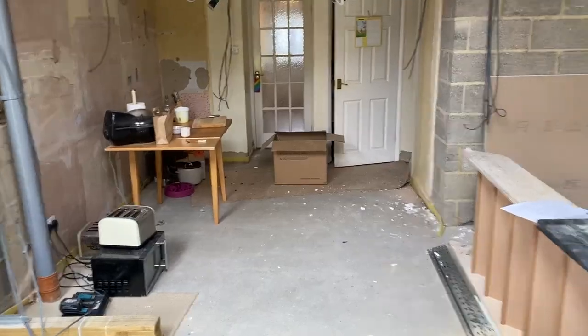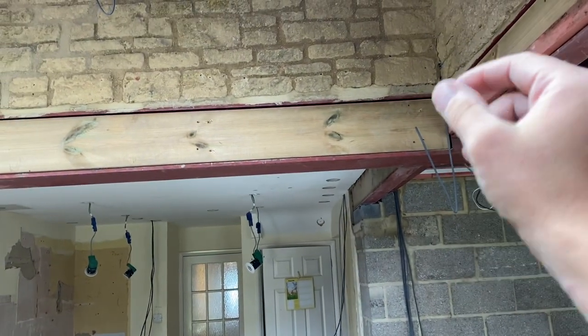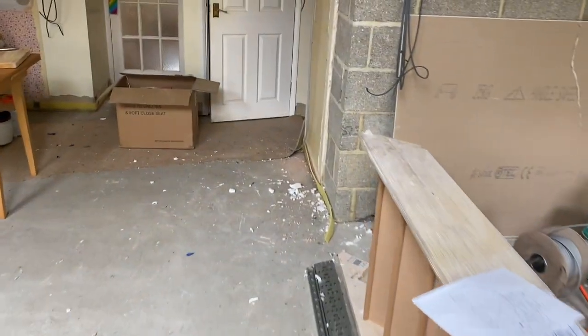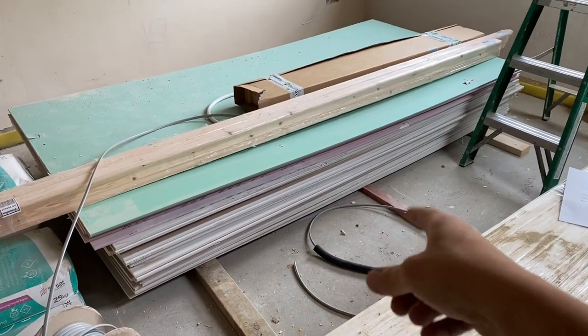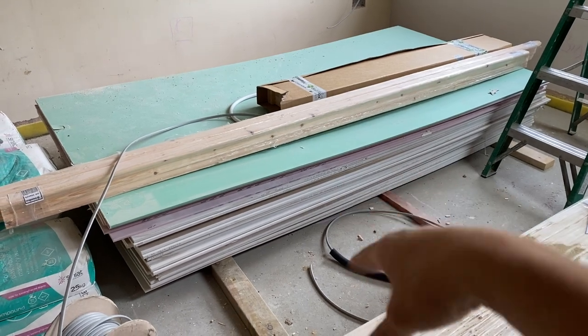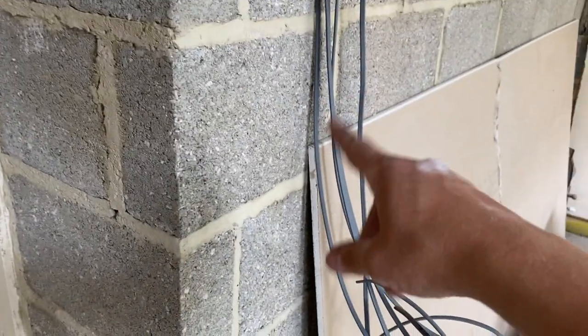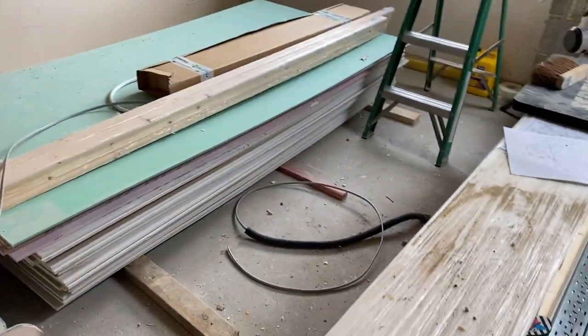One last thing: we're going to have a colour-changing LED up here. I've mounted up a bracket — that'll be wide enough for the driver. There'll be a controller for colour changing. Under the pelmet it's just going to be warm white off a normal switch, and these are also going to be warm white off a normal switch. Because I couldn't be bothered running a switch cable all the way around the houses, I'll put a 3-amp fuse spur off this radial — socket, then 3-amp fuse spur — and put a kinetic switch or Click Mode wireless switch here to turn on this island pelmet light.